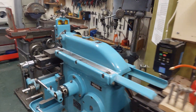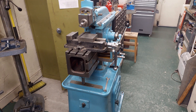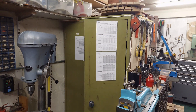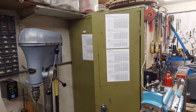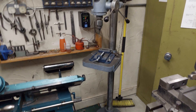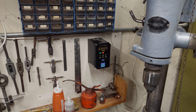Moving along, here's my Alba shaper, which I use for some bending iron shaping. I used to use shapers exclusively and had two running simultaneously, but they take a while and I've now got a nice big milling machine which is much quicker. The shaper is still very versatile so I use it for quite a few things. It's powered by a variable frequency drive which gives me lots of speeds in between my main five speeds — really handy for all sorts of things.